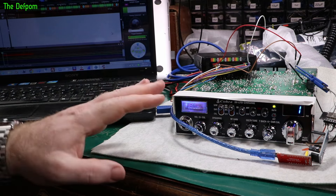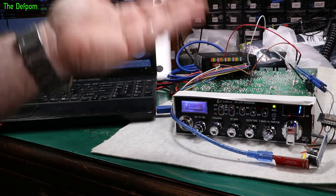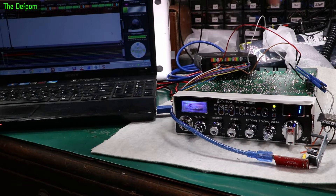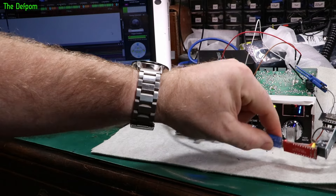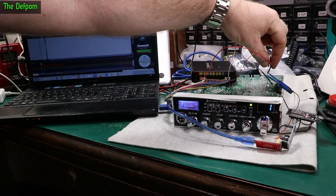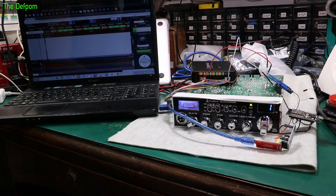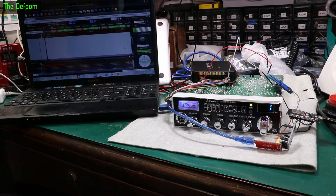I'm still working on this and making progress slowly. There's already a chrome version I've worked on before, but this AM/FM version has new circuitry causing the complication. I've got probes hooked up, a Zero Plus logic analyzer, and some microcontrollers — an Arduino Pro Mini and an ESP32. I've got a couple of diodes in series to protect the ESP32 since it's not 5V tolerant — it can only do 3.3V. I also have pull-up resistors on the ESP32.